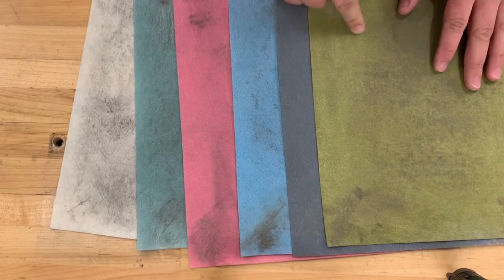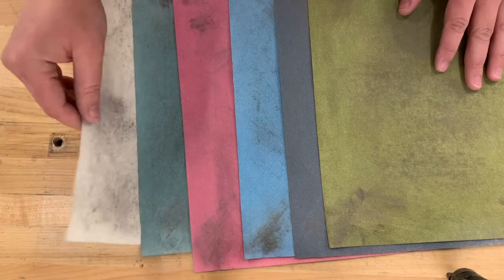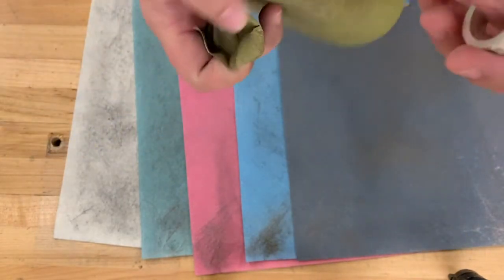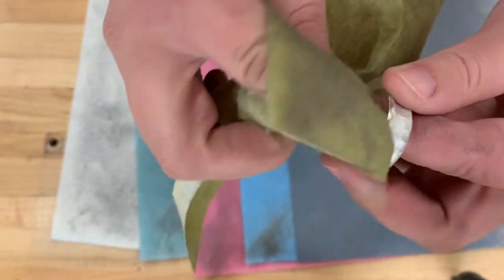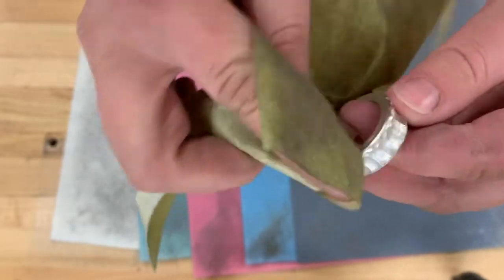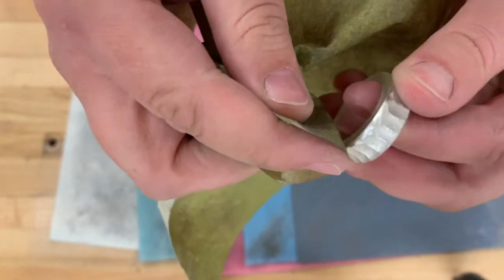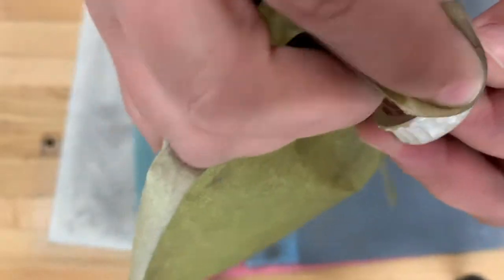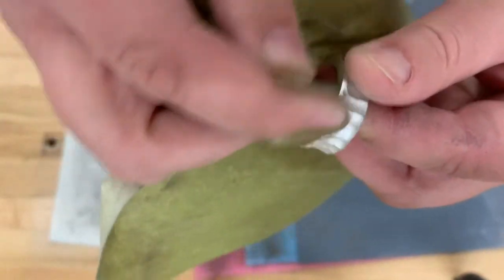It comes in different grades: green, gray, blue, pink, this sort of mint color, and then light green at the end — it looks almost white. You just take it and go around your ring like this, kind of like it's sandpaper, and this will give you a nice, really subtle polish. It's almost like a step up from 600 grit, this green. But if you take it all the way to the final light green, that will give you a mirror finish — and you can imagine it takes a little while to get there, but it definitely looks really nice.